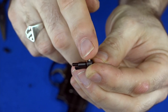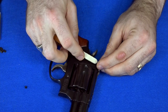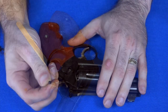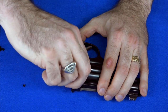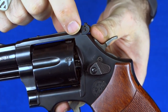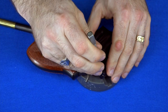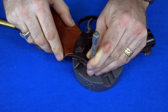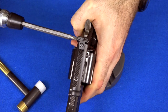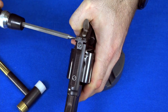I've put the little plunger and spring back in the new blade sight and I'm going to put that in there. Then I'm going to use a popsicle stick to push it up in there while I slide this down so I don't scratch anything. And it is in. Now I have to take the other little nut — the replacement nut — and put it back on this side. Once you get that little nut in there, you see that little hole in the little screw — you've got to tap that to spread it out a little bit so that it holds inside that nut and locks it in. So you just take your little tap, stick it in there, get it to where it's solid, give it a little tap, and it should be locked in place. To test it, just crank it and it should move the screw without coming out of the setting. It's working fine now.